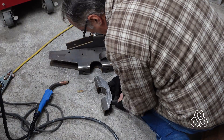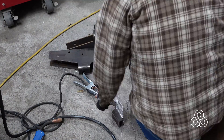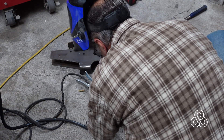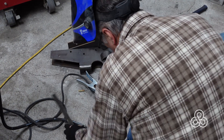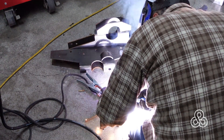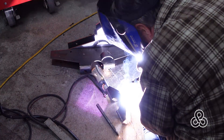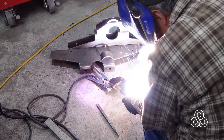To help bear the weight on there — same thing so we don't have just the quarter inch riding on the bearing surface — we're going to add a couple of pieces of pipe that have been cut in half, slide them in and weld them in so they will be riding on the pipe. That spreads the weight out and gives a little more bearing surface for the grease that will be in there as well.